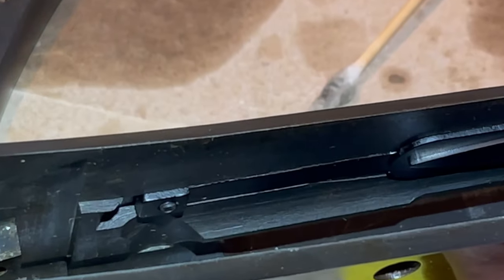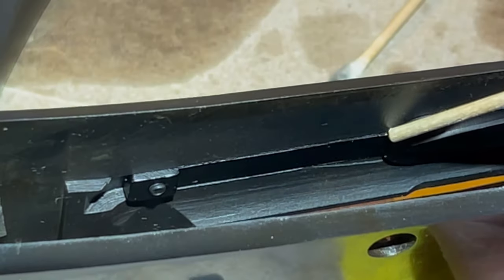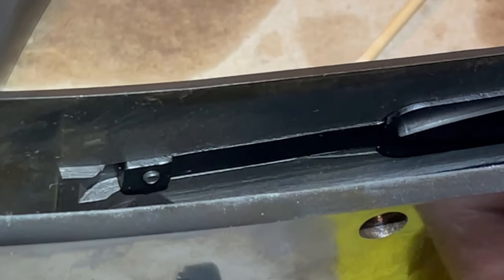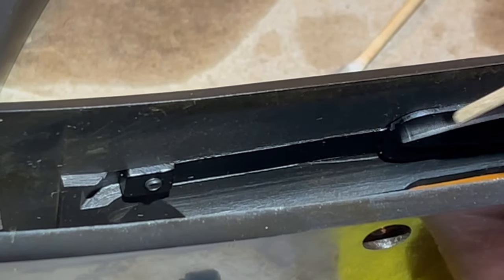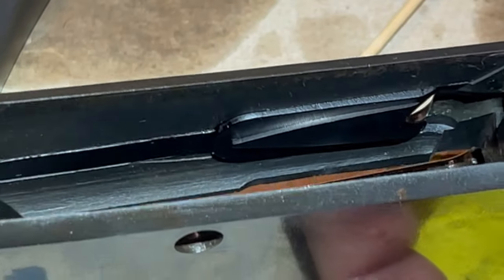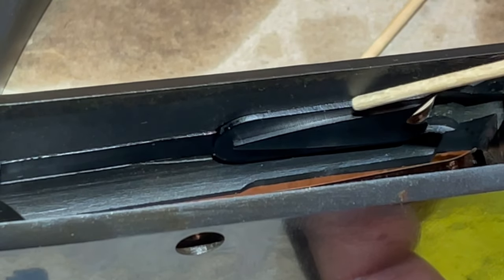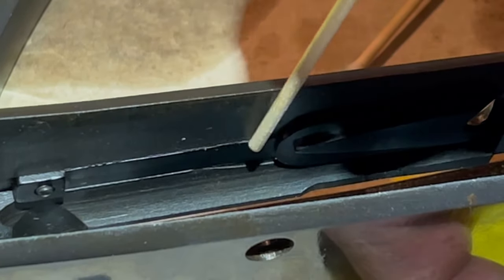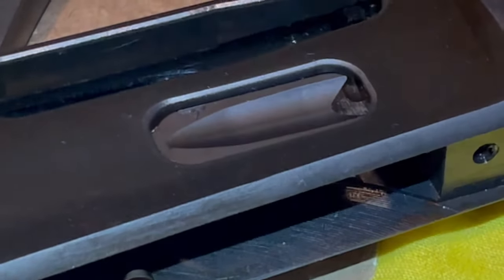This did fix it — all I had to do was manually bend it. As you can see, it is seated all the way up against the receiver wall, from where the screw is all the way down. If you get one of these and it's protruding — meaning there's open space showing — that means the arm needs adjustment. Just adjust until it seats properly up in there. This worked pretty good.